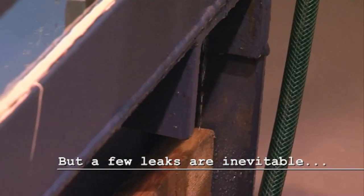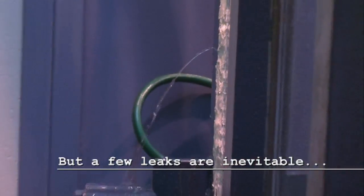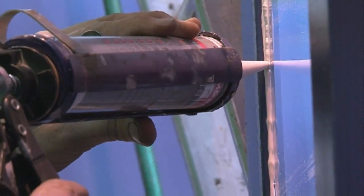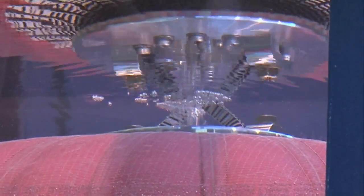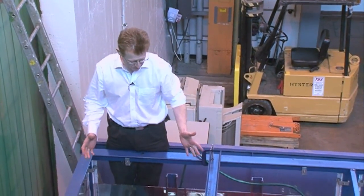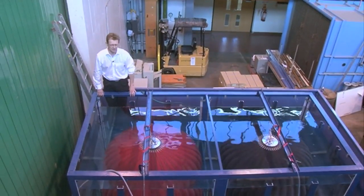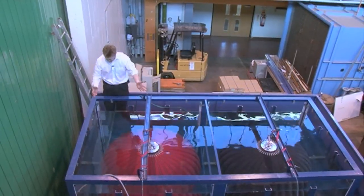You can find out where it is — it's actually popping it out down below. There's a bit of pressure in there. So we're about seven feet of water in there. We could put another foot in, but the bags, as you see, are completely covered. We're seeing a few tiny little air leaks from the top of each of them, which is just to do with us not having tightened up bolts as tight as they should have been. But basically everything is working fine. We've got bags pressurized up now to 120 millibar — they're actually rated up to 400 millibar, four tenths of an atmospheric pressure. And everything is working fine.